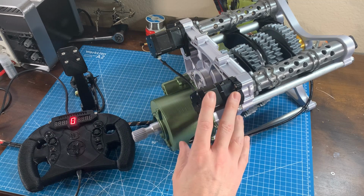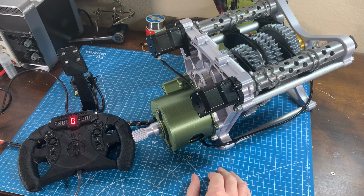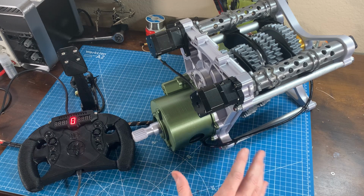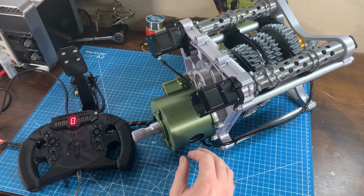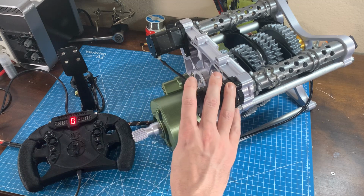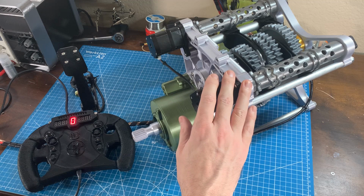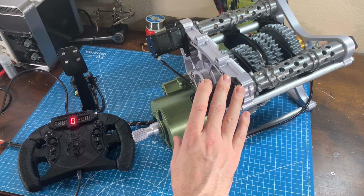Okay, so as you saw in those clips, the simulation software is far from perfect. I had to fight some more with the tuning coefficients and the algorithm that I was using for the simulation and how fast it was running. But I believe most of the tuning issues are down to the actual lag between when the motor is given a new target RPM and when it actually reaches that target RPM. I think there's a bunch of ways to address this, and I'll try to fix that potentially someday.